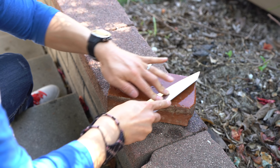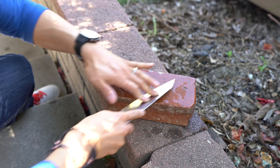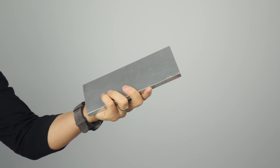If you've watched some of my repair videos, you'll see that for knives with chips of two to three millimeters I typically go to a 120 or even a 140 Atoma. So the 140 and 120 are the grits I use to fix anything with a large chip. The bigger the chip or the damage on your cutting edge, the lower grit you want to go.